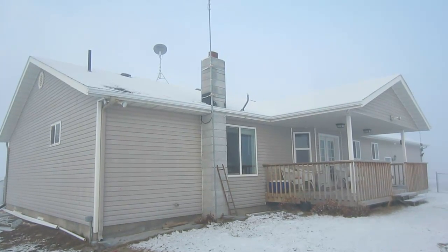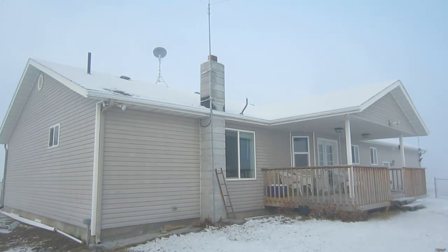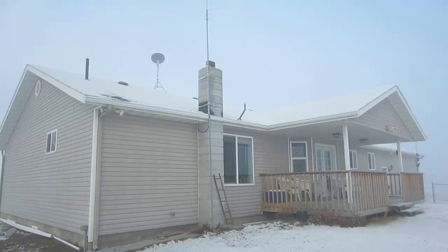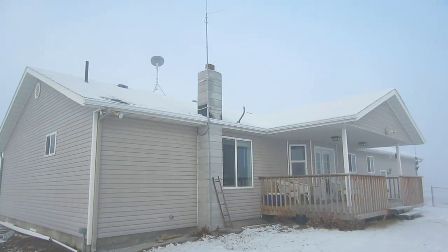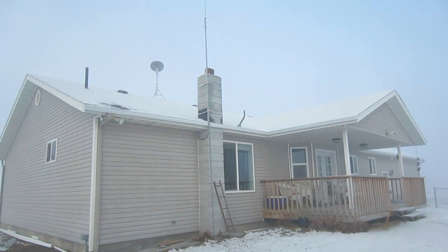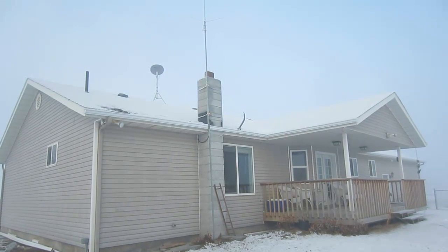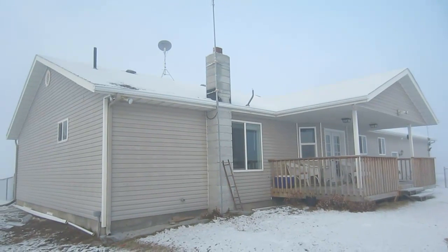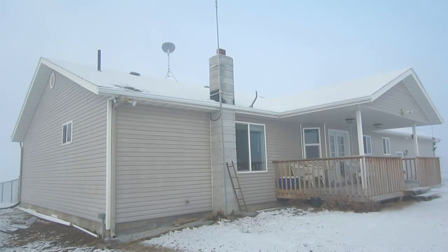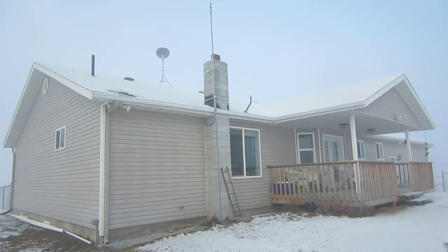When you're looking to mount your panels on your roof, you want the most amount of south-facing roof as possible. My house faces east and west, and so the only south-facing slope I have on my roof is over my back porch — certainly not enough space to mount 21 solar panels. You can mount them on the east and west of the roof, but that's going to dramatically reduce the power you'll be able to generate, because the ones on the east will only be working at full productivity until the sun goes to the west.